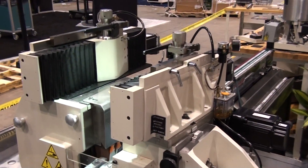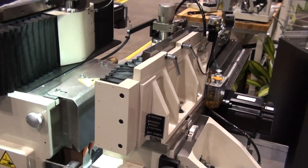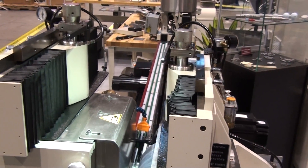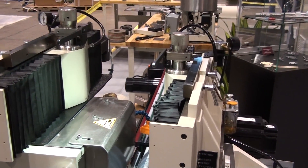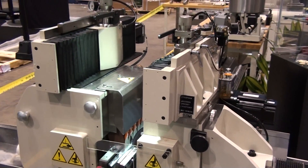The regulating wheel, with its 2 and a quarter inch, 57 millimeter spindle, and Timken bearings, allows for the most demanding applications to be ground with zero deflection. The 8-inch diameter regulating wheel allows for closer tolerance with larger diameter work.